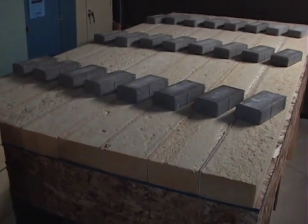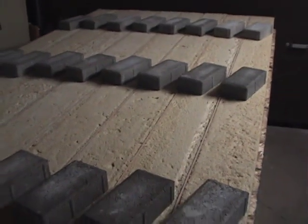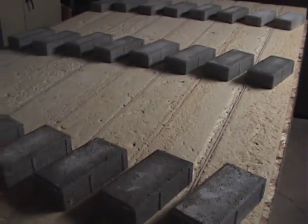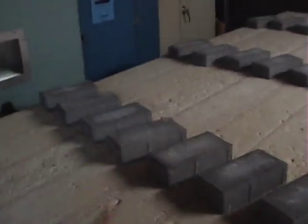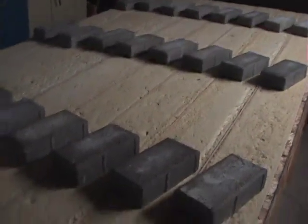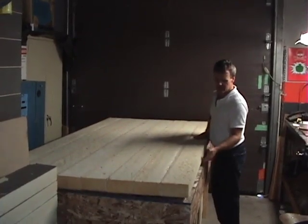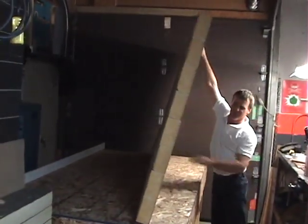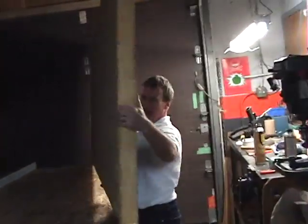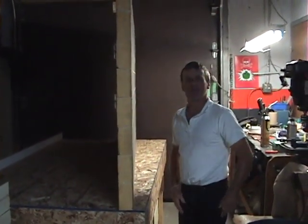The whole four-foot section is all done. We just need to wait about 30 to 45 minutes max, and then we can lift this whole section off. The stones are in place to hold it down, and once I lift it up I'll remove those stones. Now I've removed all the stones and — lifting — as you can see it's all one solid piece. It's pretty light, about 40 pounds at the most. That's how I make the walls. Thanks for watching.